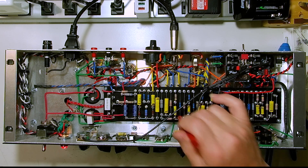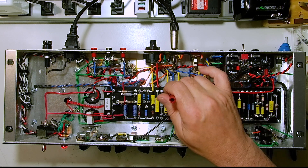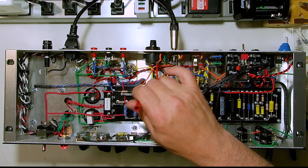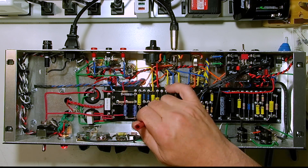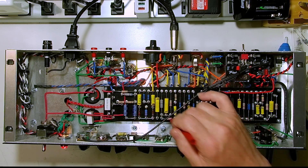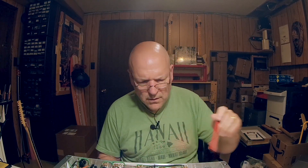By the time you get to the end, any noises would definitely indicate loose connections. This amp is good and solid. I'm not going to go around the real high-voltage stuff, but we'd know if something was wrong there. Tapping the tubes isn't giving us anything — good solid amp.